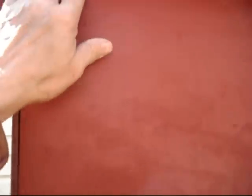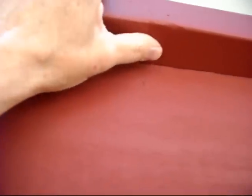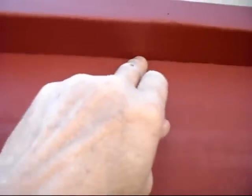So we'll do it. We'll fix it up. What I did here is something I should have done here. This plywood on the front that I put on yesterday is, as this 2x6 rises up just a little bit, wedged in there real tight. And hopefully there's no wicking action, taking up water and stuff, or warping. Here I had a little depression for the two pieces of 2x6 coming together where I patched a stump a few years ago, and I wood rasped that out, but it didn't give me enough clearance. There's a space here, but up here there isn't.